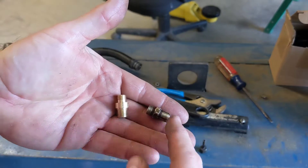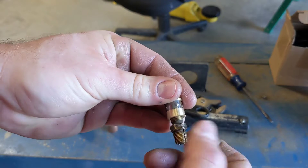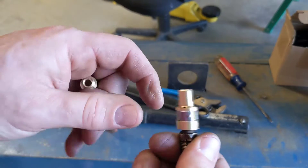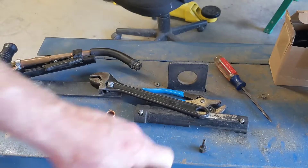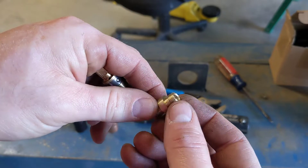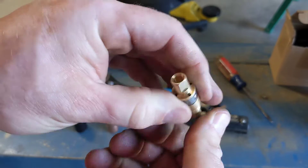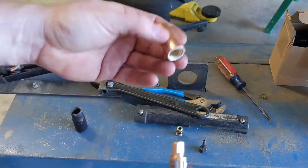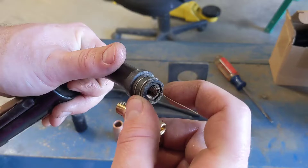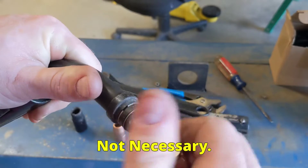Here's what I've come up with. This is the original piece with the slits in the side - even though our new piece would thread on, those slits would allow gas to escape through the sides into the atmosphere. So I've made a new piece without those slits: it's 1/8 NPT on this side, 3/8-24 on this side. This will thread on to accept the new gas nozzle, gas comes out the end, and the 1/8 NPT has a relief inside for the liner. I'll put some Teflon tape on that to seal it.